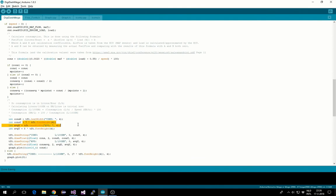Then it does some calculations on where to draw it on the LCD and calculates an average, which is done over here. It's very crude but it's just prototyping. I'm not even sure if this calculation is right — engine load is already an estimation made by the ECU — so I really don't know if this is correct, but I'm just trying to start measuring and see if I'm getting anywhere near the actual consumption, which I calculate every time I go to the gas station.